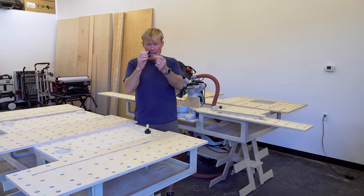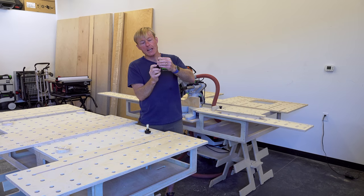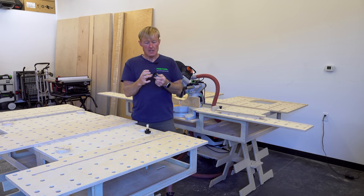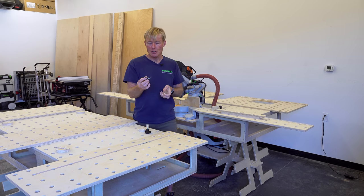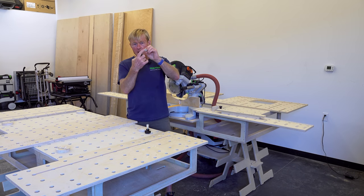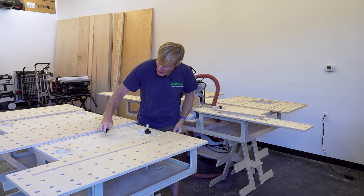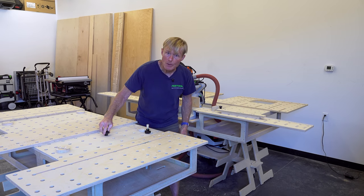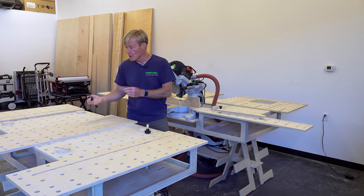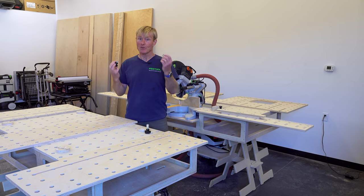They already made really nice high quality heavy knobs called speed knobs that go into many other bench dogs — they quickly spin and their weight makes them work a lot better than less expensive mass-produced ones. Any six millimeter knob would work in this thread, but the shoulder on it fits from underneath and bottoms out against the 20 millimeter hole, so you don't need a washer. They spin off so nicely and quickly, staying out of your way — which is a sign of great design.